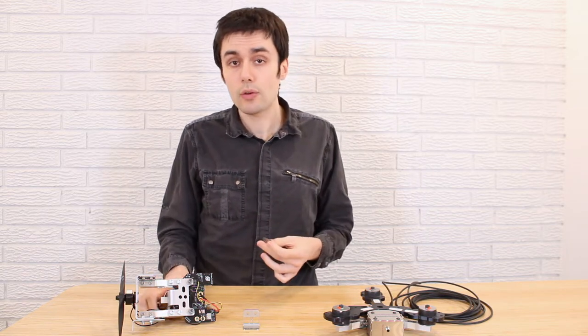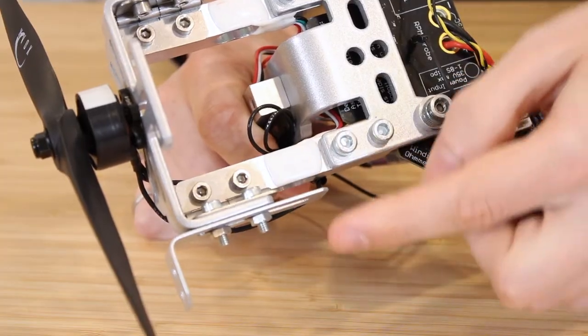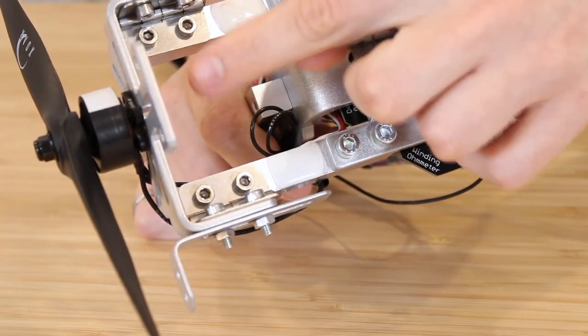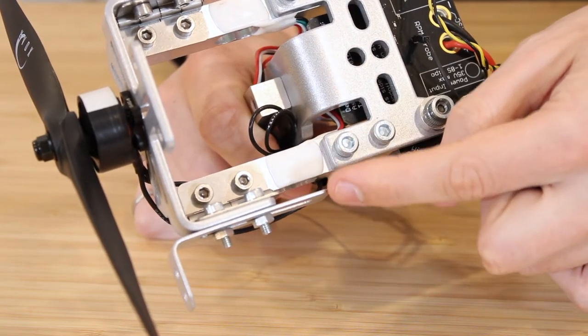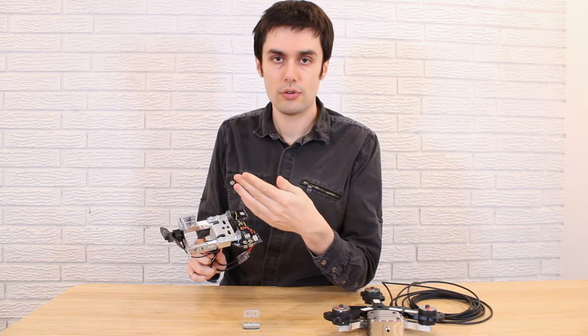This is the idea we had when we originally designed the Series 1580. For example, here you can see the motor mount, and the motor mount is applying forces on two separate load cells. This is then used to measure the torque.